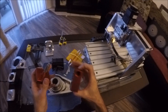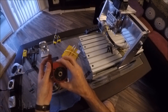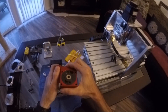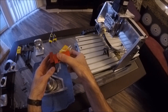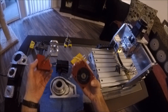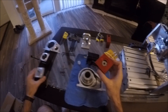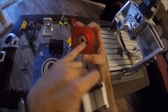This one is a worm drive. It just goes in there and threads, and the genius designers put a set screw right into the thread on here so that you could set the angle if you wanted, or just smash it tight. That's why when you see these, they're always at some stupid angle rather than being perpendicular — they're kind of off at some angle because they never phased the threads here with this. You could probably shim it, but I'm not doing that. I'm just going to thread it on and maybe throw some thread locker in there. The way this engages on the motor is with a roll pin drilled through the shaft, and that just engages this slot in the shaft there.